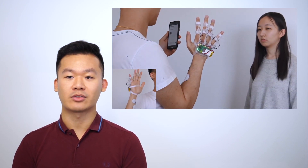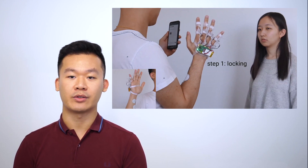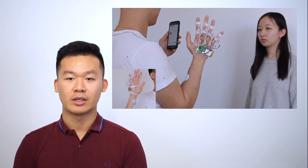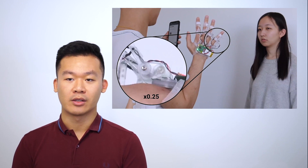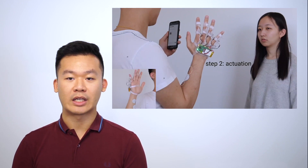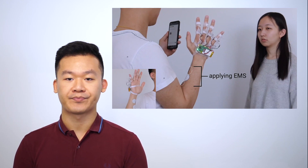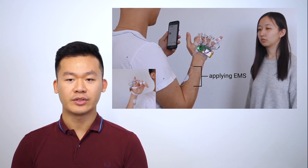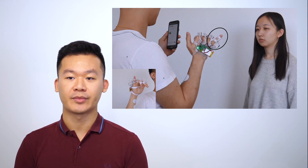Let's break down how Dextrems actuates the fingers to render the letter I. First, the exoskeleton locks the pinky finger with the mechanical brakes. If we zoom in closer, we can notice a ratchet mechanism being engaged, which will lock the finger in place. Then Dextrems moves the other fingers through EMS with electrodes attached to the forearm. Notice that the index, middle, and ring fingers contracted, but not the pinky — because the pinky was locked by the mechanical brakes.